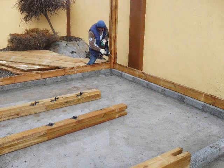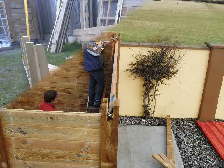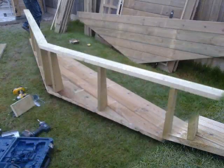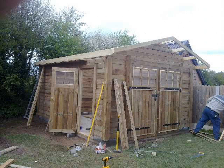Garage build. Garage assemblies are worked off the same principle as the stable builds. Once again, it is advisable to use a concrete block plinth when assembling a garage. Here you will see a canopy. It is easier to assemble and attach the canopy onto the apex working on the ground, and then fixing it into position onto posts later.